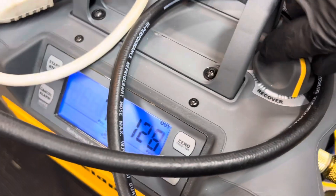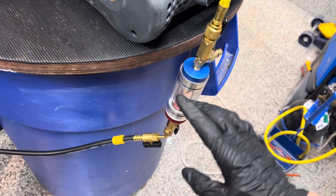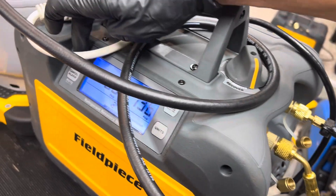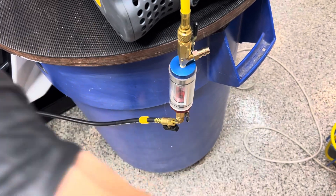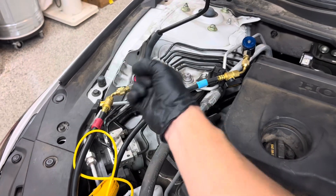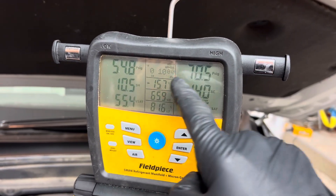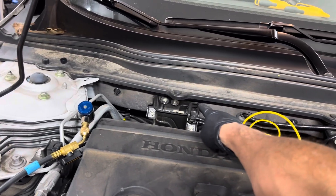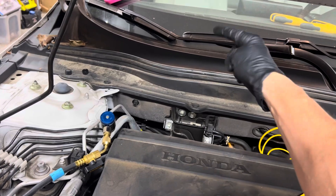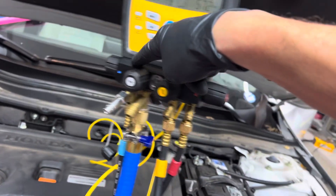So we'll open it up a little more until we find the right happy spot. There we go — we're at eight. There's refrigerant going through here but you don't see it because it's vapor — no oil. Now if I turn this all the way open, that number jumped up to 25. If you keep it wide open, liquid can come up. We don't want liquid. We're only pulling from the low side, not the high side. We don't want to take liquid out because then we remove oil, and you don't want to remove oil because we're going to recharge this. The low side is going down; the high side is higher because it's only pulling from the low side, forcing liquid refrigerant along its normal path through the expansion valve, through the orifice, into the evaporator, and back up the suction line.